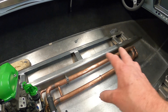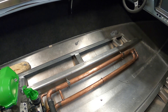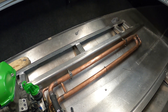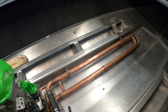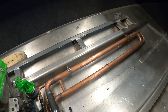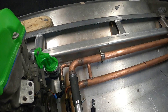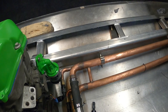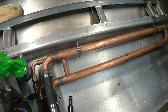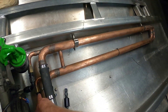Apparently the formula for this is for every 100 horsepower you need one meter of copper pipe, so we've got about two and a half meters — that's good for about 250 horsepower. It's an approved heat exchanger concept that's been around for a long time, and jet boat shops sell these types, but we made our own. All you need is about 20mm inner pipe, slightly smaller than the outer. You just drill through the elbow, chuck the inner tube down the middle, drill through the elbow at the other end, and bring your smaller tube through both ends.